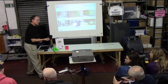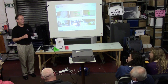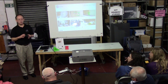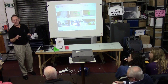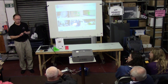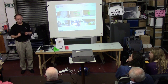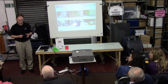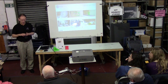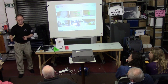This is a project we've only just started — it's a proof of concept. My son is into model aircraft, and we wondered if it would be possible to 3D print a complete working aircraft on a RepRap. It's not sensible for most things because it's not the right material, but as a proof of concept, this is high-impact polystyrene. It prints rather like ABS, it's soluble in limonene — the oil that makes oranges and lemons smell — it doesn't shrink very much so it tends not to warp, and it's incredibly light. We've only built one section so far, but just feel how light that is.